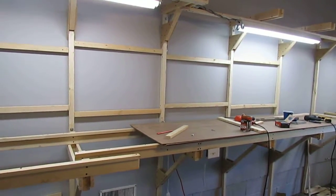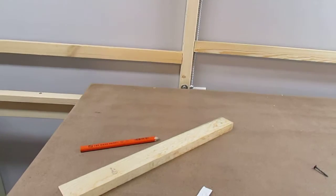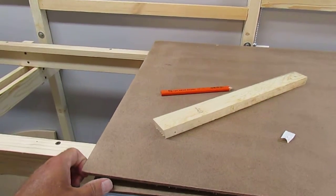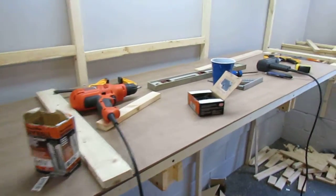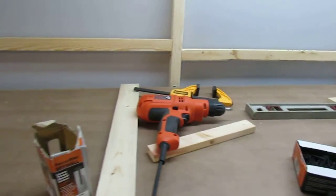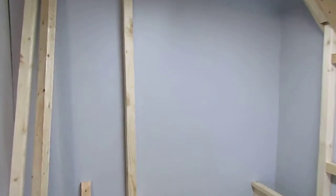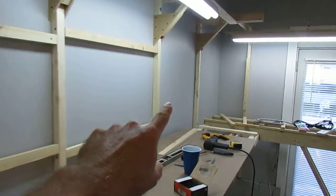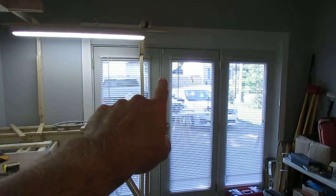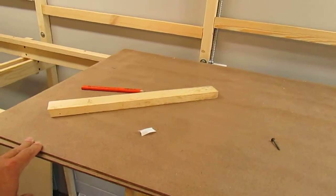Okay guys, so the next step that I took to get the backdrop installed was I took these 1/8 inch 4 by 8 sheets of hardboard, the tempered hardboard, and just cut those in half to create two 2-foot sections. So with my backdrop starting at this pilaster right here, curving around, going the length of the room, curving around and coming back out just beyond that pilaster over there is 23 feet. So I needed 3 sections of the 8-foot by 2-foot tempered hardboard.